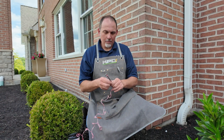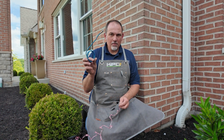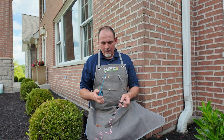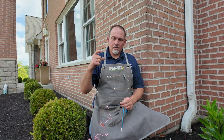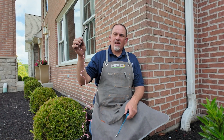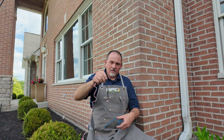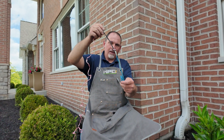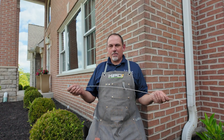This makes the tip of my pull string somewhat rigid and will allow me to use a magnet. This particular magnet is a flexible magnet you can get from labor-saving devices. You could also use a telescoping magnet like you'd find on a tool bench — you can get something like that at Amazon or Harbor Freight. When I drill my hole, there could be some depth to it, so I feed the pull string up into the hole, get it over any obstacles, drop it down, then go from the other side with my magnet, grab those washers, and pull the wire right through.